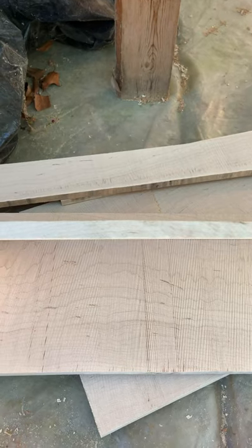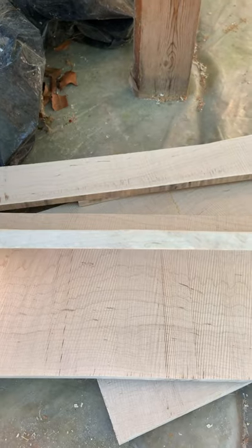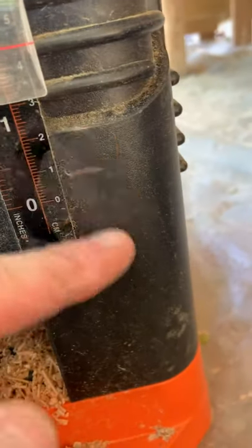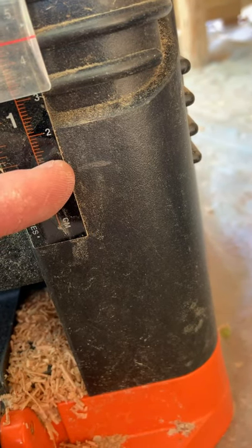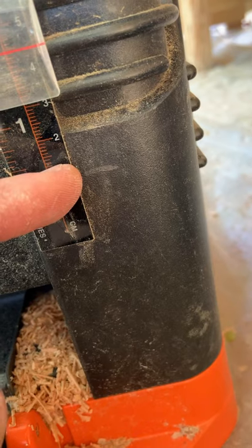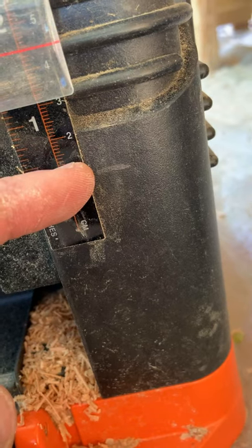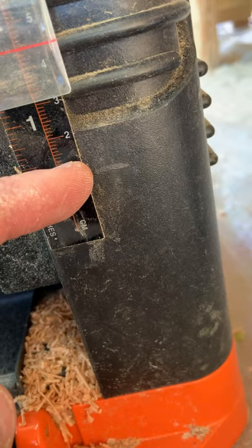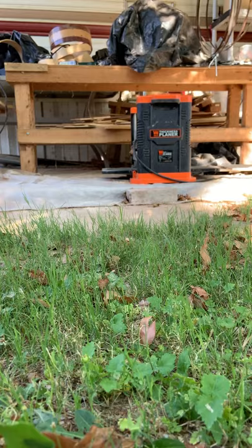At the end of the process I like these to be a quarter inch, so when I'm planing them I plane them quite a bit proud. I actually have a little mark on my planer that seems to be about the sweet spot — that gives me enough leeway when sanding and doing all that to not have to worry about taking off too much material, and still working them in a manageable way after being steamed. I try to feed them in one right after the other just to avoid snipe.